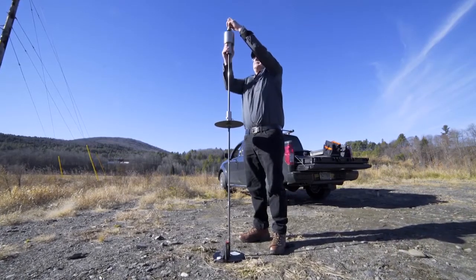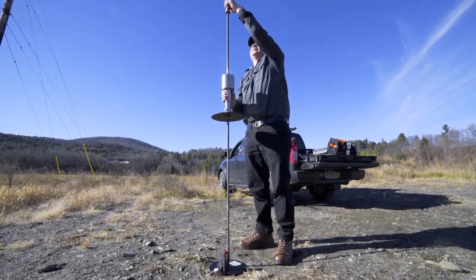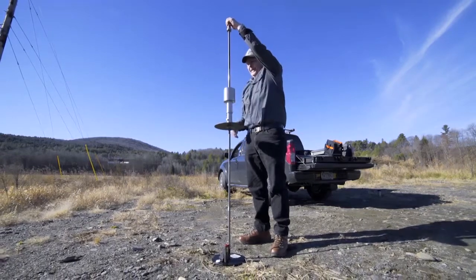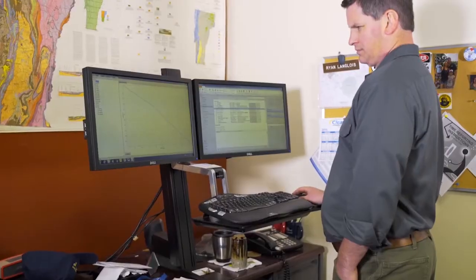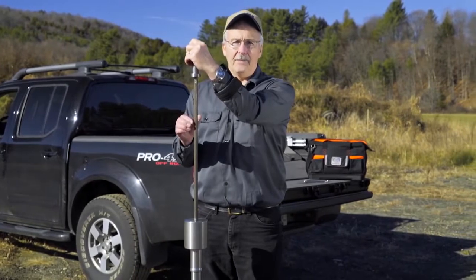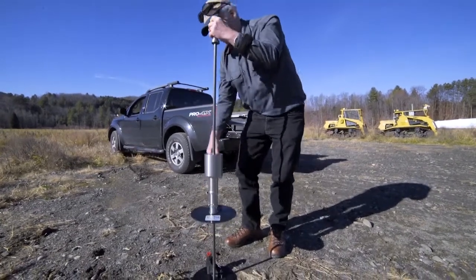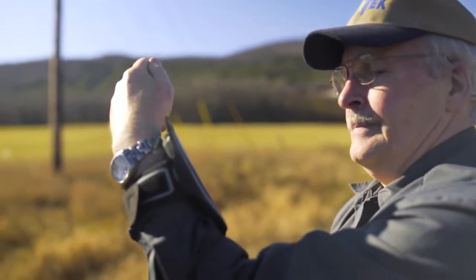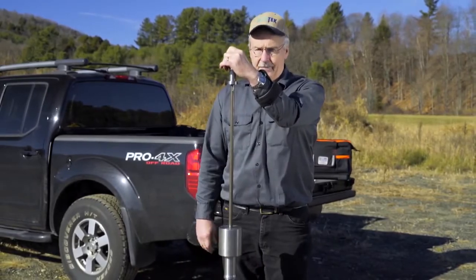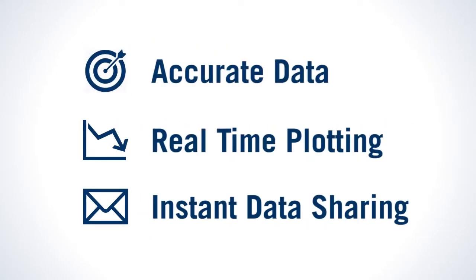While we continue banging on this test, one really nice feature is that you're able to get your data and see it as it's happening. As soon as I'm done with the test, I'm able to attach a small CSV file right to an email and get it right back into the office immediately. This Smart DCP kit will enable you to automate your existing DCP units as long as they have the 5/8 inch shaft for standard mounting. This is a great way to automate the old way of doing it — you get more accurate testing, immediate results, we're gaining a lot of efficiency, saving a lot of time, and making a lot more tests more accurately.